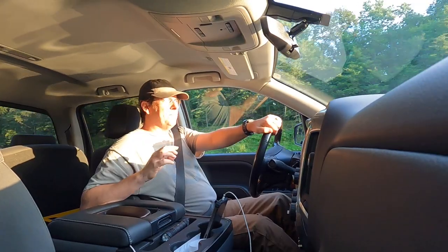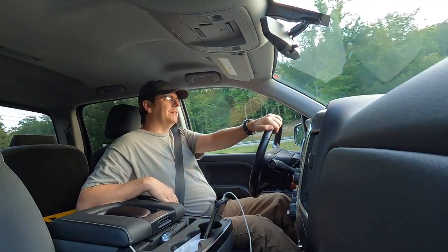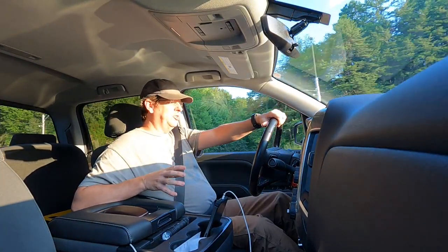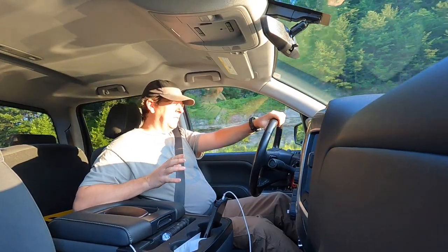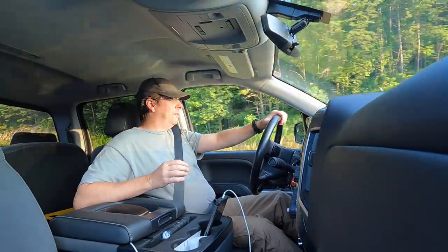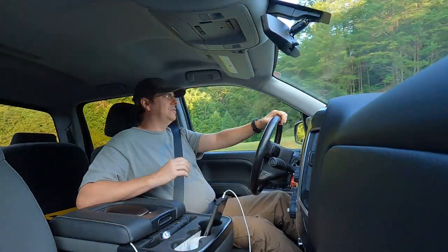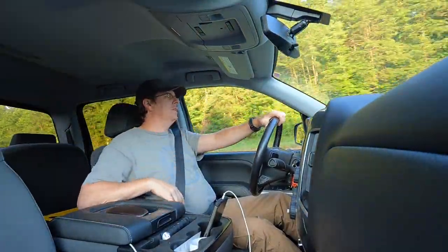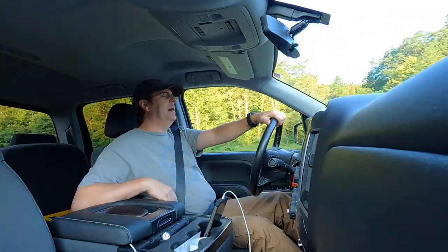I just want to get it weathered in so I can go up there in the wintertime, stay warm, and maybe start working on interior stuff. Weathered in means sheathing, roof, windows, and doors in. What we're doing today is going up to camp, choosing a location, doing a little clearing, taking measurements to figure out how tall the piers need to be — because the ground slopes away — and that'll help determine what type of foundation system we use. We definitely want to do pier and beam. So that's what Dad and I are doing today — just a day trip up and back.